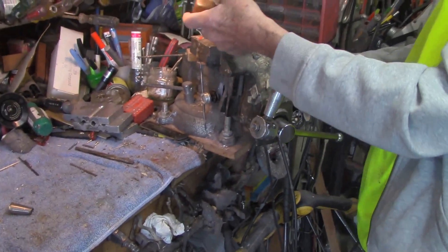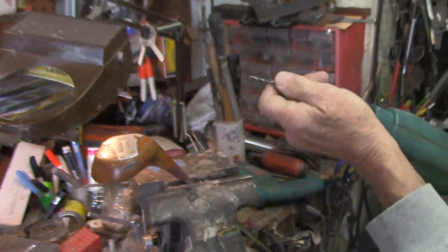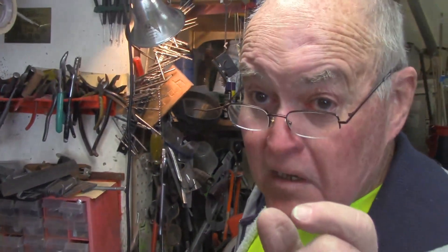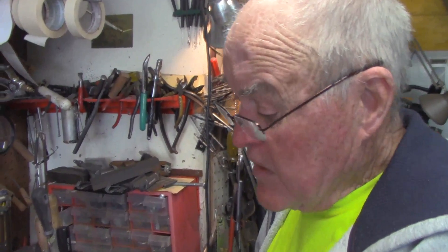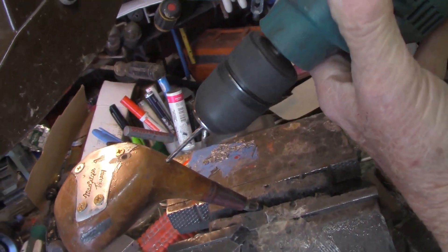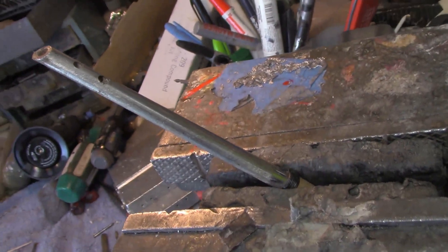While I've got this here, I'm going to mark the location for the back screw, because we're going to go back and pin that thing again. That pin hole might not necessarily line up because this is coming from a different shaft. Sometimes I'll use a half-pin — only get the back half — which is better than nothing rather than try to drill a complete new hole. Most modern epoxies will hold it, but the pin is good both cosmetically and practically. We're going to mark this and see what happens when we go all the way through.